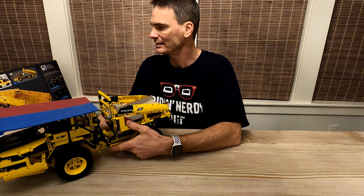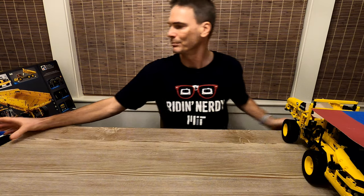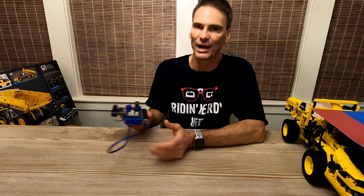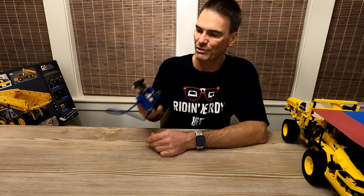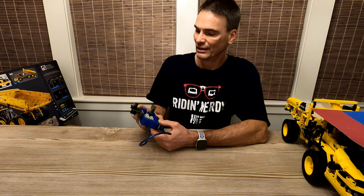Okay, so finally, the things I'm going to be working on next is kind of pushing the envelope of the Pixie camera. The resolution when it's all the way up on the ceiling isn't the best. So I've got a fair amount of errors that come in as far as the angle of the color codes and kind of their positioning. So I'm kind of pushing the envelope of this. So I might think about changing this out or coming up with a different plan for a camera to give me better resolution of everything. So I'm going to work on that.